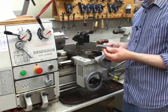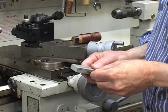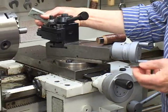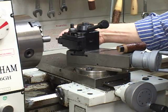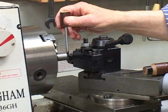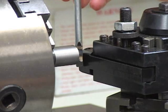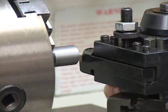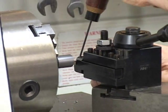Before actually making a cut, in this case we're going to start with a positive lead angle tool. We're not going to do anything fancy such as hone these flanks — simply removing the burr on the rake face will suffice for our simplified sharpening instructions. Next we have to insert the tool bit into the tool holder and get the stick out correct. The stick out for the tool in use is going to be 0.234 inches. I have a little gauge that is turned down to 0.234 inches with a couple of flats ground on it. I move the cross slide forward, trap this gauge in place, and withdraw the cross slide — it comes out quickly. Now my stick out distance is set. I'll simply insert the tool, use my right hand to hold it in the slot keeping it in contact with the back of the slot, and then use my left hand to tighten the set screws.